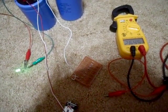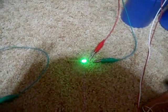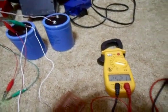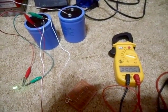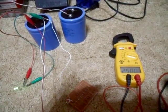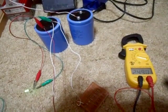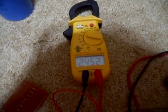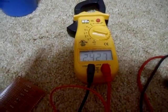I did this earlier and it just dropped to like 2 volts and stayed there, and the LED stayed lit for over 35 minutes. We're going to be here all day waiting for that to go out. When I did it with the 1000 microfarad, it stayed lit for over 10 minutes. So this is going to stay lit for 100 times longer before it goes completely out. It's just stuck at 2.5 volts now — as it goes down, the voltage drops less and less.